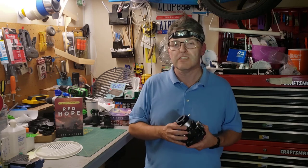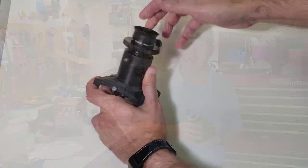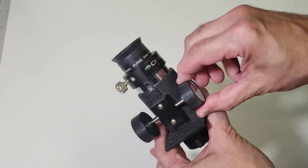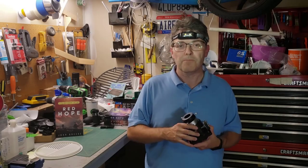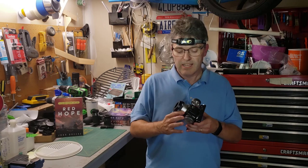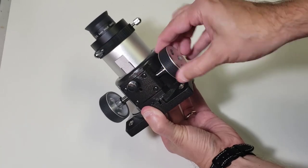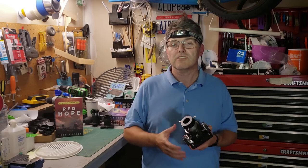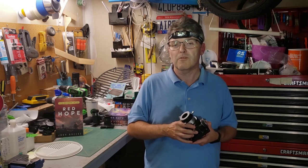Almost all of the focuser styles that you'll see out in the wild can fall into one of three categories. The first is the helical style — you don't see this very often these days. The second is the classic rack-and-pinion style, seen on a lot of introductory level telescopes. They're easy to use and very affordable, especially for new astronomers. Then, of course, there is the Crayford focuser, which is becoming more and more common. I see these as a sign of quality. Pretty much you can't buy an 8-inch Dobsonian telescope without it coming with a Crayford focuser, because the Crayford focuser has essentially eliminated all mechanical slop, and they just work wonderfully.